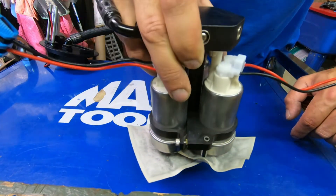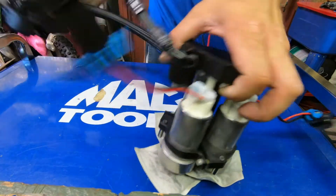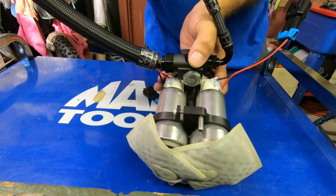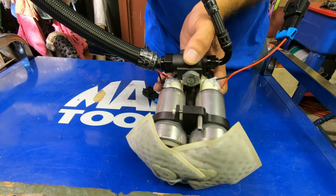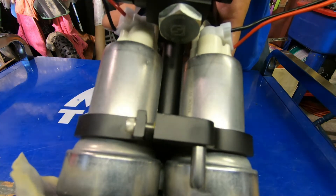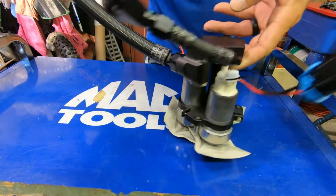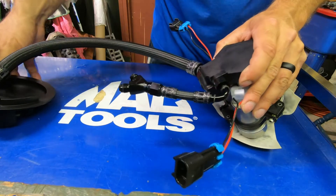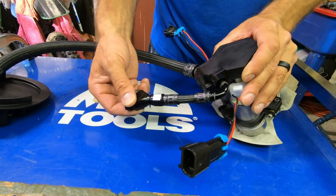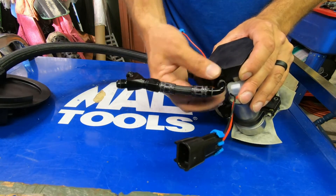Here's the manifold. There is an integrated check valve — it's a Parker valve, a very robust unit made to handle hydraulic pressures up to thousands of PSI, so 75 PSI is no big deal. We also have a jet pump feed to run the jet pumps on the front of the bucket.